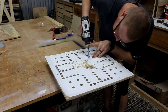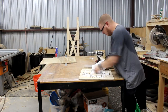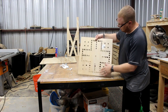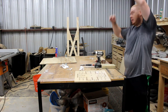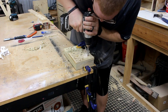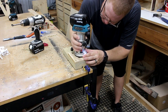I was wrong — there were actually five holes I could not reach with my drill press. There is some blowout on the back; we'll sand that up and clean off the blowout so it doesn't look so bad, but it doesn't really matter since this is just a template. After finishing the board, I decided to drill some holes in a piece of scrap wood and test using a round-over bit on these holes to see how it impacts the collar fit.